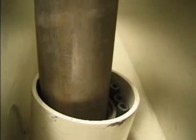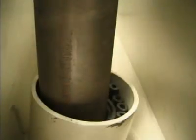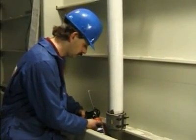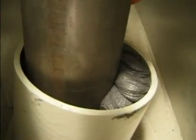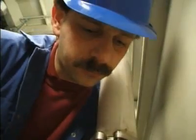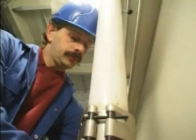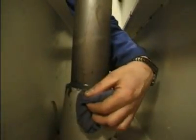On the top side of the penetration, extra sleeves are inserted to fill any gaps. The sealant is applied and then pushed into place with the moistened cloth. Finally, the sealant is smoothed down and any unwanted sealant is wiped off with the cloth.